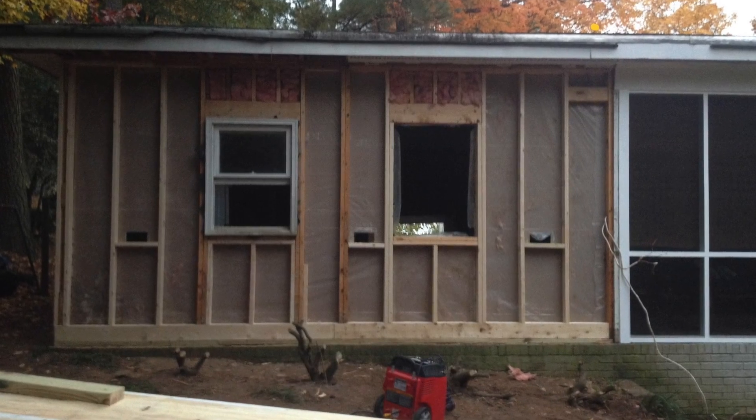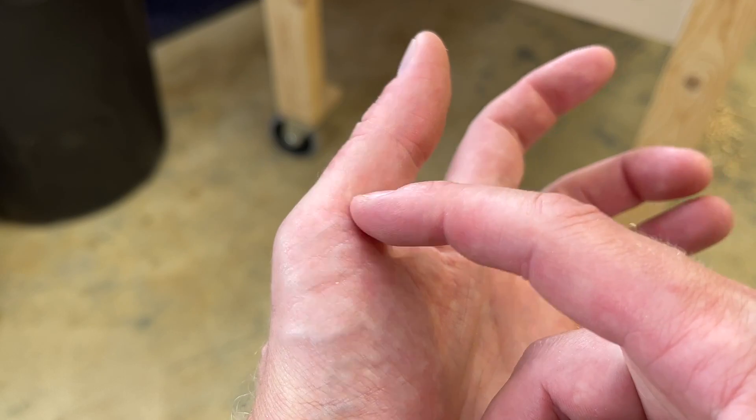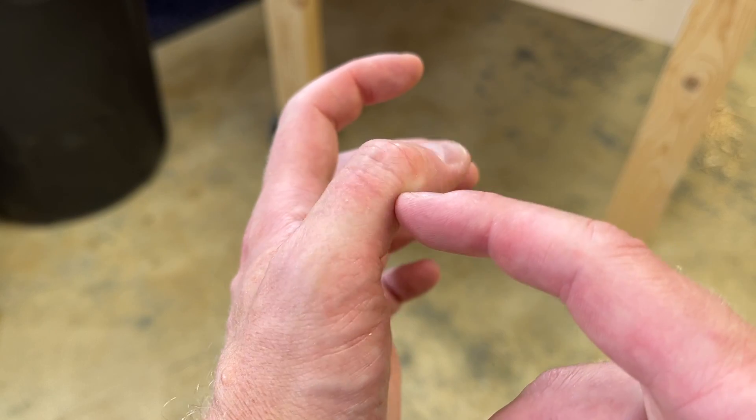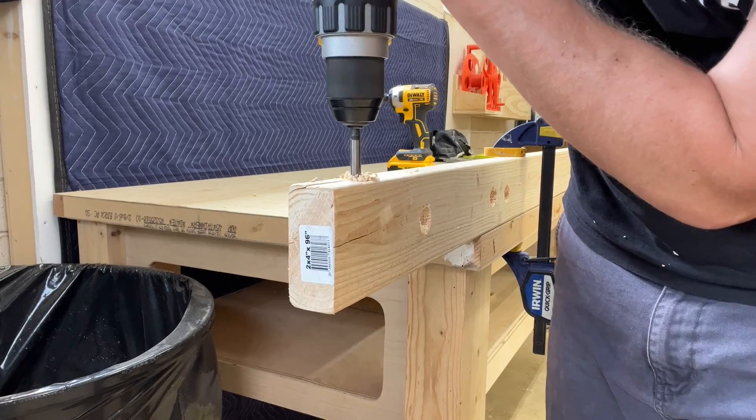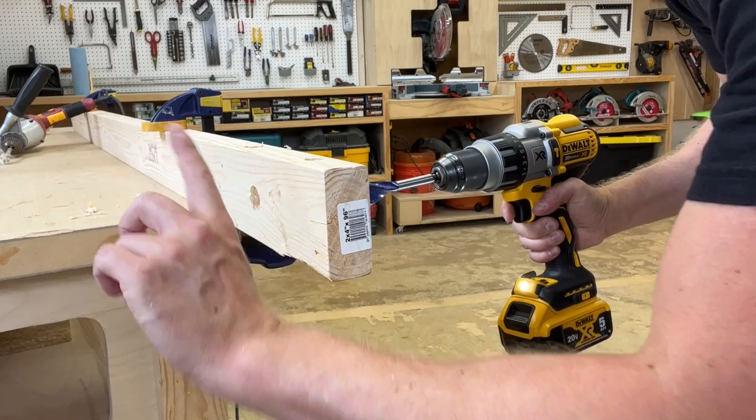When you punch through material, you absolutely need to keep your free hand out of the way, because these things are merciless coming out the other side. I was boring holes through studs in winter once and left my hand a little too close to the exit point. The spur points broke through, grabbed my glove, and sucked my thumb back into the hole. I was 100% convinced that I had cut my thumb off. But it turned out the glove had torn and bound up the flutes — I had bloody chatter marks on the edge of my thumb, but no ligaments torn, no bones broken. It was kind of a miracle. The lesson is that the spurs won't distinguish between flesh or wood. They'll just keep cutting, so keep your hands clear.